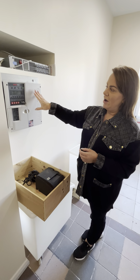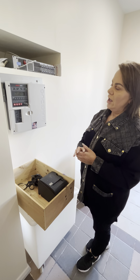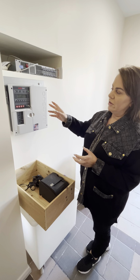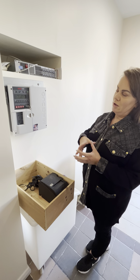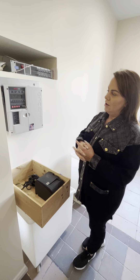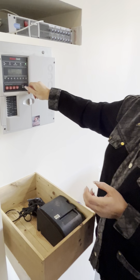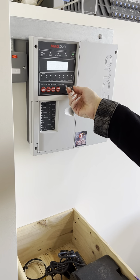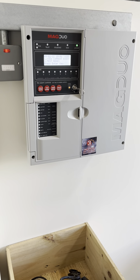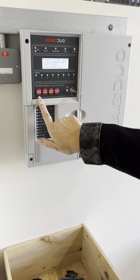We have the fire alarm system for the building to keep everybody safe. In the event that the fire alarm does go off — maybe it's a false alarm or maybe it's an actual alarm — you come to the board and turn your key to the left. You'll see the screen light up here. To silence this very loud alarm so that you can check the building, just press silence alarms once.